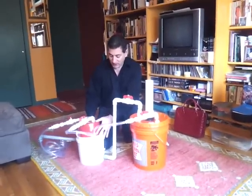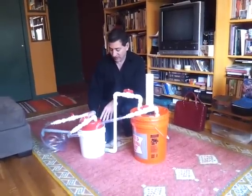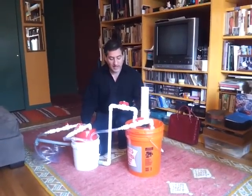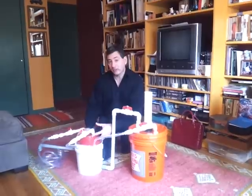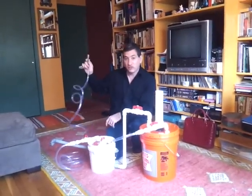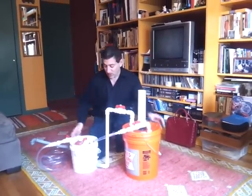By having both stages active you maximize output. As winter comes and the bacteria slow down, you can still use the open drum as a gas collector. Since you're filling it with warm water daily via the effluent feed, it stays above freezing even when it's too cold to make gas. The gas goes out to the kitchen stove, the fertilizer spills into the garden with most of its energy content removed, making it great for composting. This is the entire setup — what we have on our porch in Germany produces half an hour to an hour of gas per day.